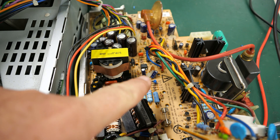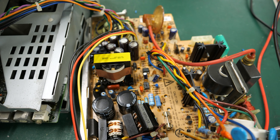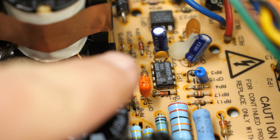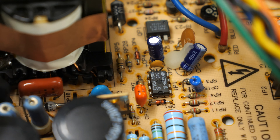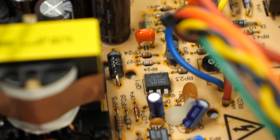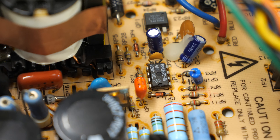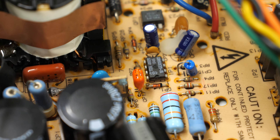I've checked out a lot of the diodes on the board and they all seem okay so far. It turns out these ICs can also cause problems — one of them is the TDA4605, which is a kind of controlling circuit for switch-mode power supplies. That often goes bad, as does the optocoupler. Between those diodes and those two parts and maybe a voltage regulator or a MOSFET, those are my next best culprits in terms of trying to get this thing fixed.